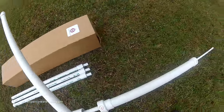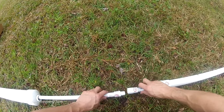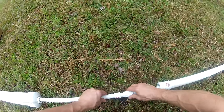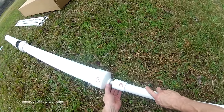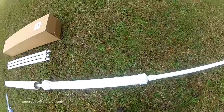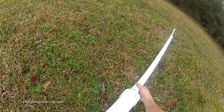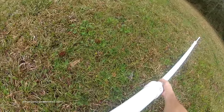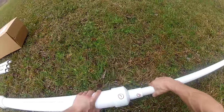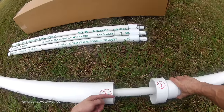It's time to connect the remainder of the riser pipes to the assembly. Connect as many of these as you need to reach the bottom of your well. Making this connection here helps if you have two people, one on each end of the pipe to screw it together. However, one person can do it if they can reach both ends. You'll want to use PVC primer and PVC cement to finally connect the two well screens.